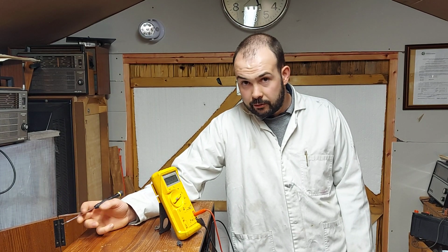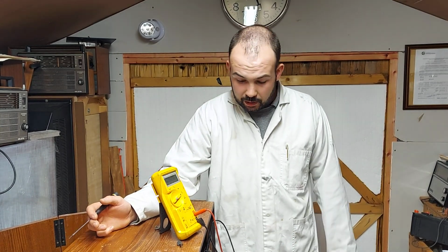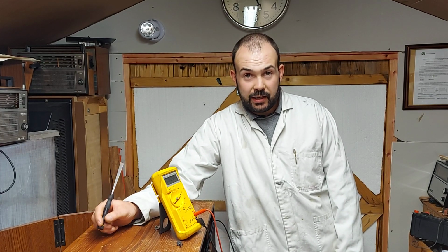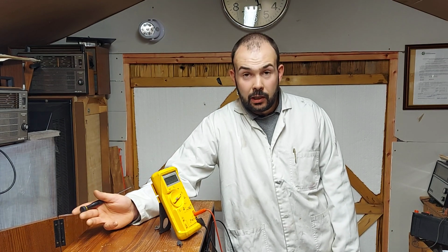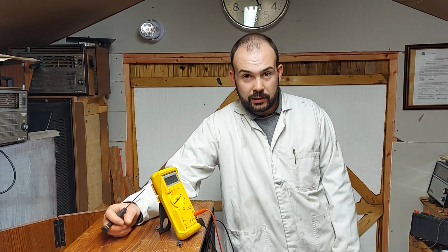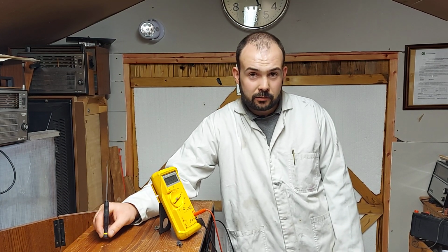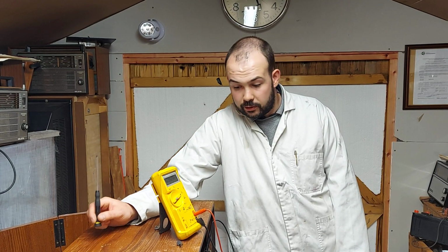But it is an excellent way of drying out line output transformers, instead of faffing about removing them and putting them into ovens and all this kind of crap. You can leave the transformer in situ. You don't need to put a soldering iron near it. I've been warned by a couple of seasoned TV restorers that the wires are so fine on the line output transformers, you should avoid putting a soldering iron anywhere near them unless it's absolutely necessary, because you can end up burning the little wires and what have you, and then you're into serious problems. You can get line output transformers rewound, but it's not something you really want to be getting into, because it's quite expensive, and in a case like this it wouldn't be viable, because the TV just wouldn't be worth it.